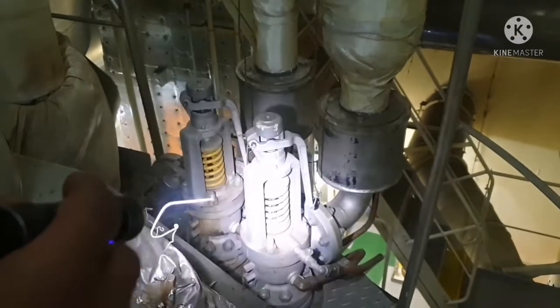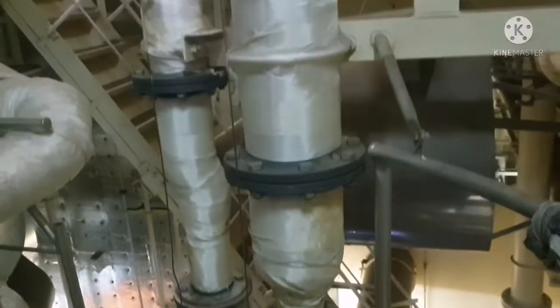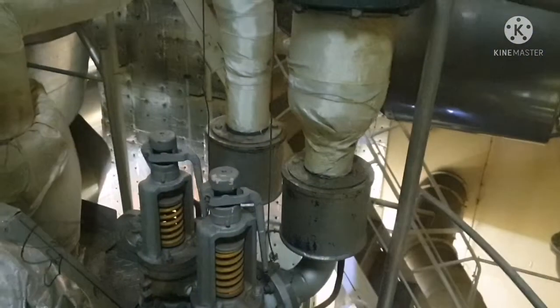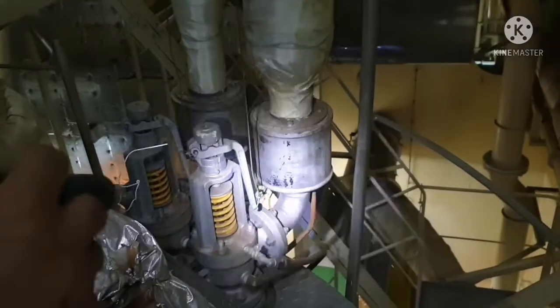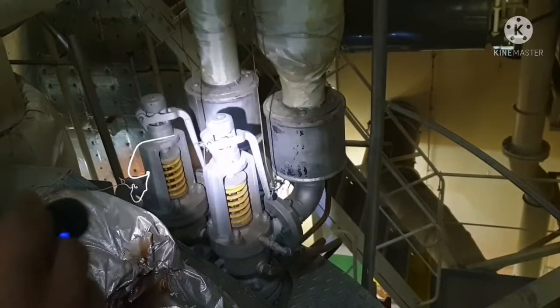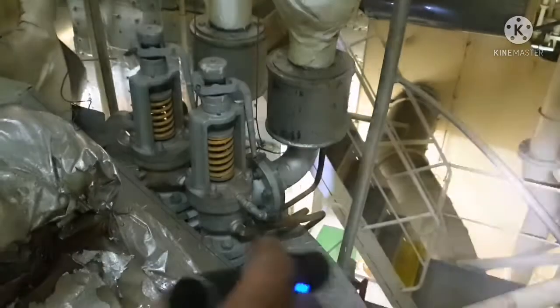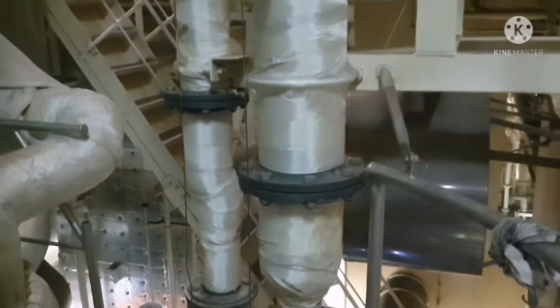You can see here these are the two safety valves mounted on top of your boiler. Both safety valves have different lifting pressures — the opening pressure will be different for each valve. You can see both valve outlets are joined with one pipe going to atmosphere. Also, you can see a wire with a pulley going down — this is for operating the safety valve remotely, so you don't need to come closer to activate it manually.